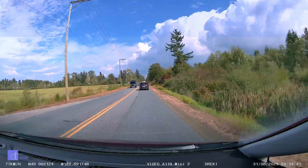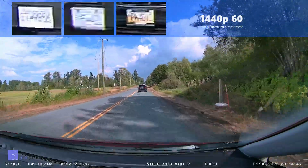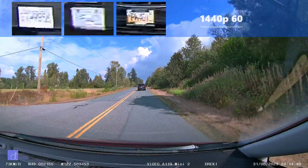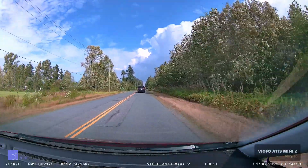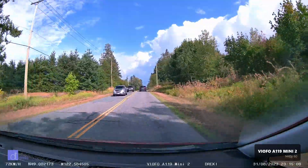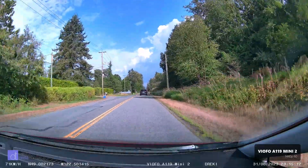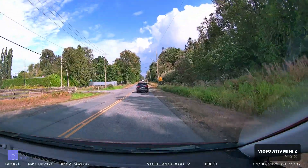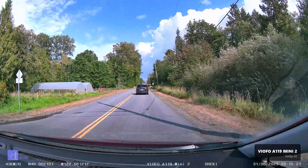Starting with 1440p60 and basically nothing is readable. I think this is less due to the speed of the oncoming cars or the camera's ability to process dynamic range, and more due to the camera's maximum bit rate at 60 frames per second being too low. That's especially the case on roads like this one with lots of overhanging trees, grasses, and other details that become compressed into blocky artifacts, causing areas with similar colors like license plates to get blown out.